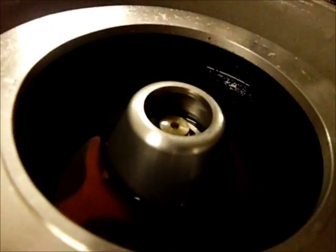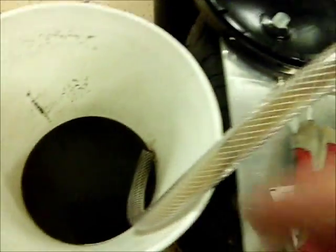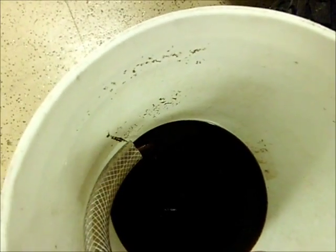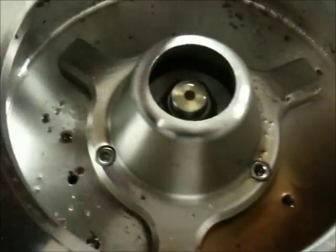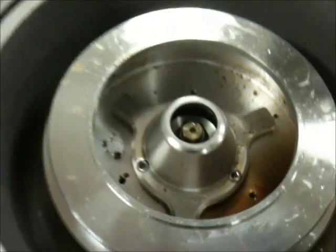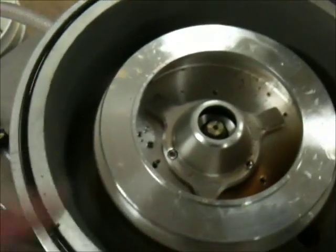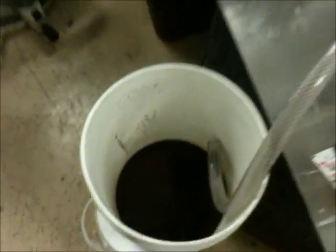It probably drains pretty slow because there's a lot of crud it catches in here. All that nasty stuff is going down this hose — water and dirt. Inside the bowl there's a whole bunch of black stuff, and good old brake cleaner takes that off no problem. You just got to blow through the little drain holes once in a while to get any chunks through. I didn't pre-filter this oil before it went in, so it's always a good idea to use a mesh screen before you dump the used oil through there to catch any big bits, because the big bits will clog those little drain holes. But it works pretty darn good — there's some nasty stuff that came out of there. We'll see you next time.